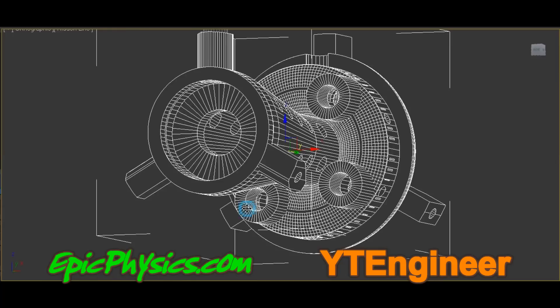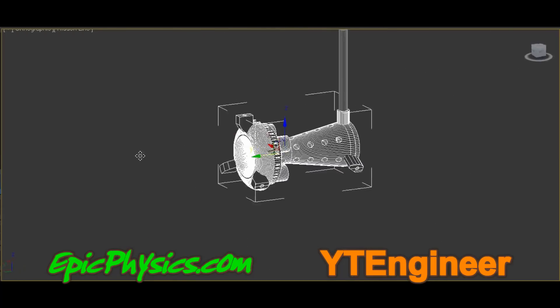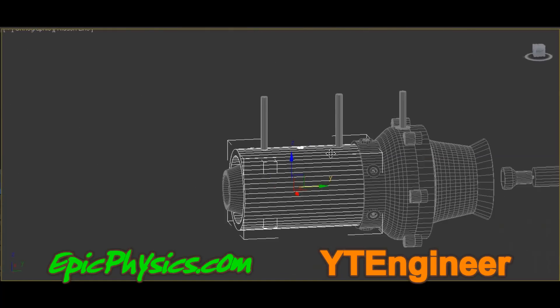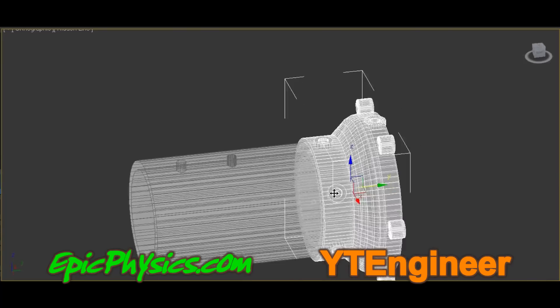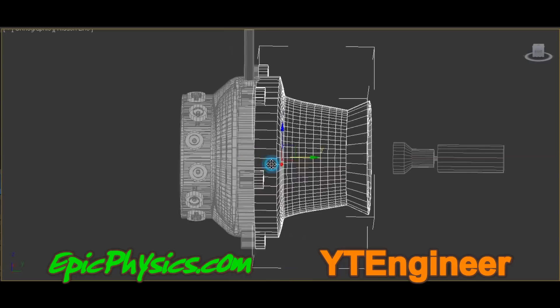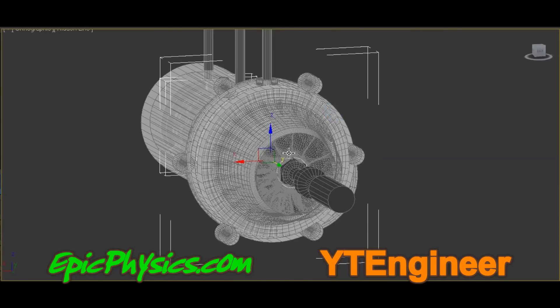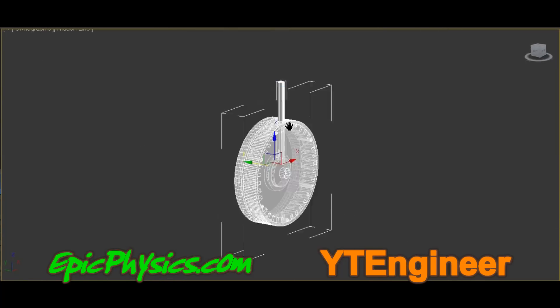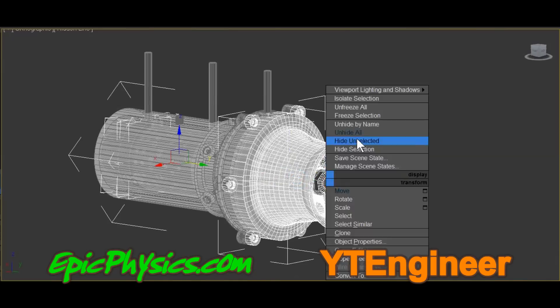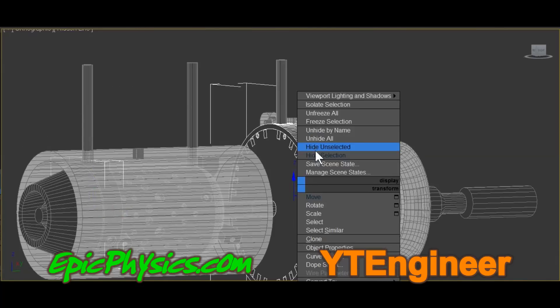The starting motor needs a very basic clutch for engaging and disengaging from the engine. I have that part designed and it is on the way, and I will make a video of it in the coming days. Until I receive the clutch I just have a basic video showing the starting motor assembly screwed onto the front of the engine. I am contemplating making the starting motor spring loaded with a Bendix clutch, but that might be making things a bit more complicated than they need to be.